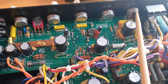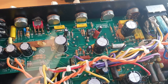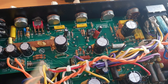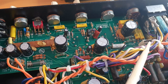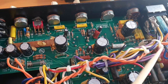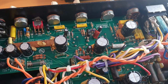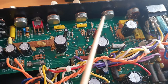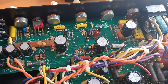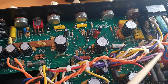The crossline is also usable and simpler, but with this one I won't have the option to switch it off and on. In the fully maxed position it works basically like a typical resistor, and I want to have 200k there. Next step will be taking the board out and seeing how much space we have here and what can be done — what parts I should use to successfully put everything I want in this amp. There's not much I want: just one preamp stage, a long tail PI, and a simple power amp. But still each of those parts will take some space, and this space is limited.